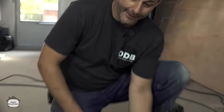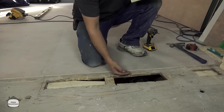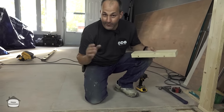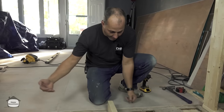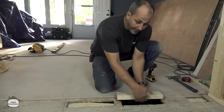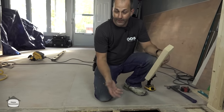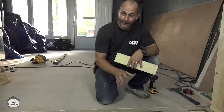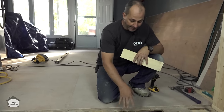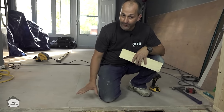If you're going to be installing hardwood, you want to put some backing in there and put the 5/8 plywood back in that hole just to create a flush surface. Hardwood you usually install opposite the direction of the joists, so if your hardwood is coming this way you have nothing to nail to - you want to create a nailing surface, that's all you need. Now if you're doing vinyl like us, we need to close this up, create a nice strong surface that doesn't deflect, and cover it with a new sheet of plywood so we have a nice smooth surface as well.